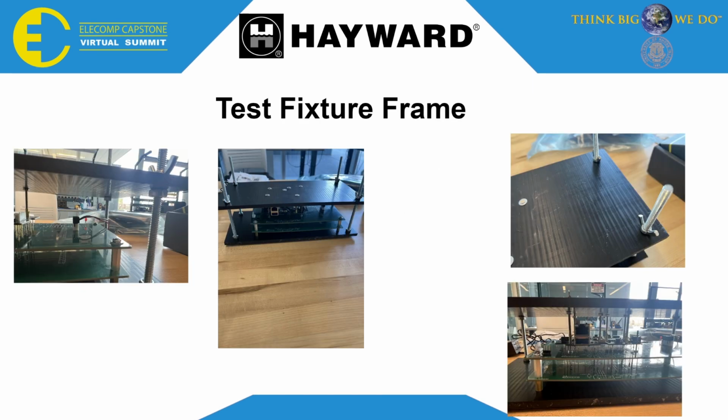So for the test fixture frame, as you can see, these wing nuts, you screw them in, and that's going to apply pressure. As you can see in the bottom picture of the wing nuts, there are 5 screws, and those screws at the tip have some sort of plastic to make it smooth. When you tighten the wing nuts, it's going to apply pressure, and that pressure is going to make the pogo pins compress, and it's going to ensure electrical connection.